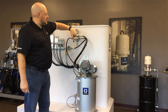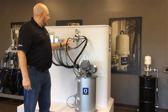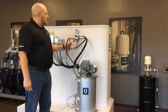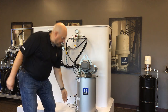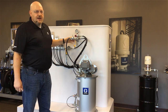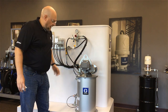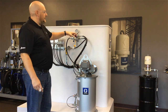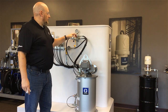The first thing we want to do is close the ball valve. We don't want to pull the plunger while we still have flow coming in from the pump, so I'm going to turn the pump off too — even though it's kind of redundant with the ball valve. Now it's safe to pull the plunger, because it just vents a little bit of pressure back into the bottom of the reservoir. If you pull on this while your fill pump is on and the reservoir is full, you can potentially damage the reservoir by defeating the autofill shutoff valve and putting flow right into the bottom where the valve can't control it. So don't hold it open the whole time, and make sure you've shut your pump off before pulling the plunger.